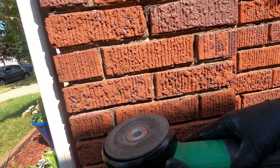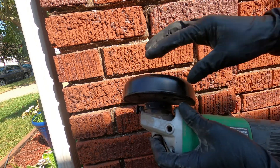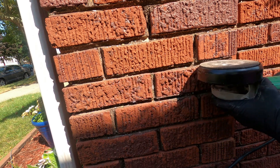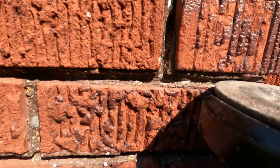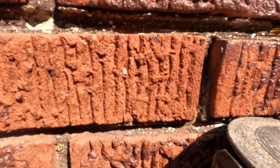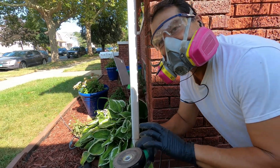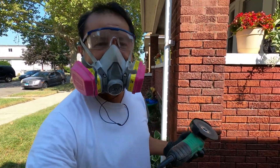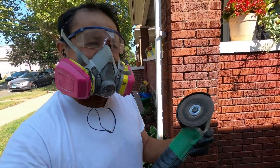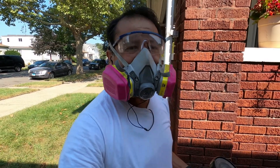When you're grinding out, it's best to have the guard this way. You gotta wear protection. If the disc breaks, it'll impact and go into your skin, and the dust will go into your eyes. When using this, I can't reiterate it enough — do not take that protector off. Because you're hitting this brick, and if that chips or cracks, it's gonna go on you. Don't wear a cheap breather mask — wear a good one, because this stuff will get in your lungs.